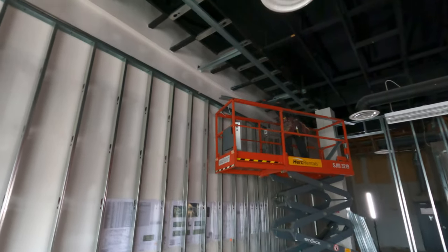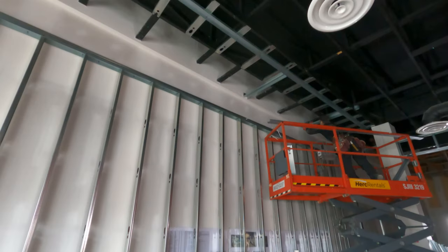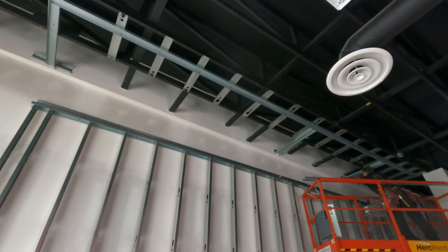Those back tracks Murat is installing are part of the bulkhead — we have a hood going in there. The corner is done just like a normal wall: overlapping your tracks in the corners. You can see the back wall where a piece of track or stud is screwed into the other bulkhead, picking up the end of the track — lots of strength there. You can also use inch-and-a-quarter screws angled down so the clip doesn't fall off. This is the back furring wall with the track face-mounted to the back wall — easy. We're dropping this bulkhead and returning it into the back furring wall.